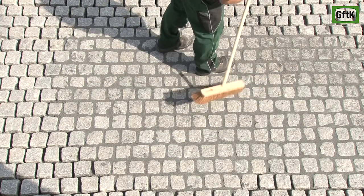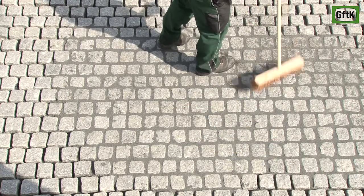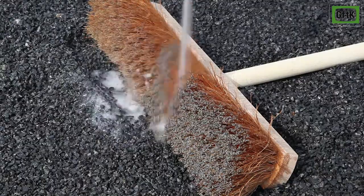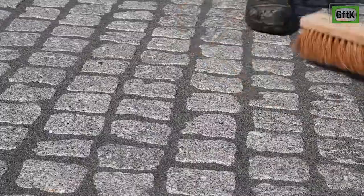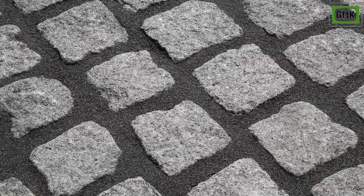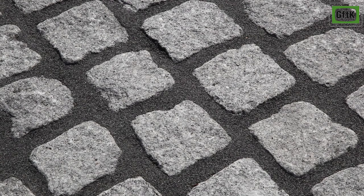Do not brush any dry mortar residues into unfilled joints. Especially when jointing larger areas, make sure the coconut fibre brush is cleaned in water frequently. Finally, remaining sand grains can be brushed off with a clean coconut fibre brush, if applicable. Perfect result! A long-lasting, durable and permeable joint with VDW 850 Plus.